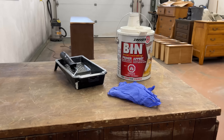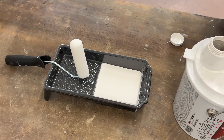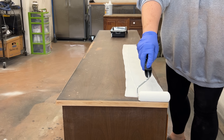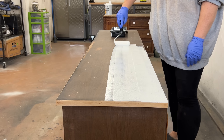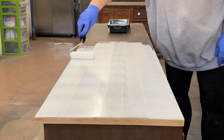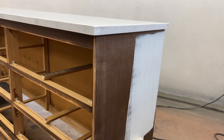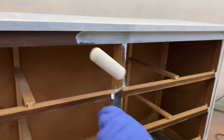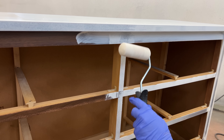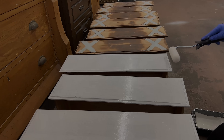I wiped away all of that dust with a microfiber cloth and then I was finally ready to prime. This BIN shellac-based primer is the one I use most often. It's definitely on the expensive side but it does all of the things I could possibly need a primer to do all in one can and it's become a bit of a security blanket on my projects. Because it's so good at sticking to all sorts of surfaces I don't really like putting it inside my sprayer and I prefer to apply it with a cheap roller instead. Beyond that extra adhesion power it also seals in stains and odors and creates a really nice hard layer like a candy coating over any porous surfaces like the MDF I exposed when I sanded the top smooth and all of those Bondo repairs, so that my paint will lay nice and evenly and not absorb into those spots.